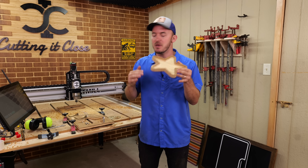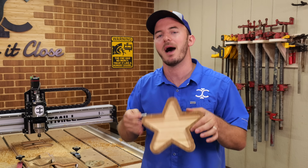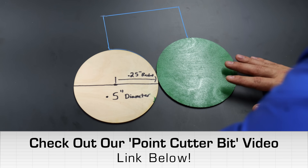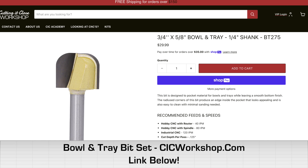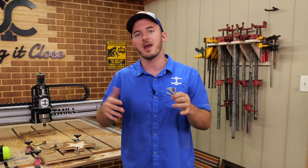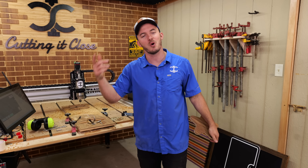Setting up that raster to go with the grain really does produce a nice finish, and having the bit come around those edges last makes a crisp, clean edge. If you want to level up this tray even more, take a quarter-inch point cutter before cutting it out and bevel and round over the inside and outside edges — it'll really make the tray pop. I have a full video on the quarter-inch point cutter linked in the description. We also have a full bowl and tray bit set including a three-quarter-inch, a seven-sixteenths bowl and tray, and a quarter-inch point cutter, all with a quarter-inch shank, so you have everything you need. Remember: if you ain't cutting it close, you ain't cutting it right.